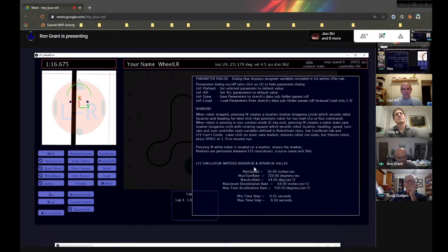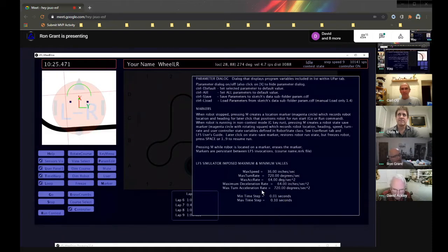So you can see this robot has instantaneous demands for speeds, but everything is linearly slew rate controlled, so the max speed is 36 inches per second, which we're running nowhere near. Even though we're accelerating the simulation, it's still taking a minute to drive around the course in robot time. But here are all our acceleration, deceleration rates. Chris noted it's pretty sluggish on the turn. A little PI line follower will beat this tremendously. But these are the current maximums, and these are what were set for the contest.